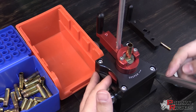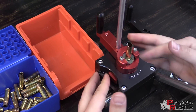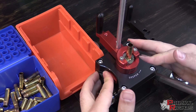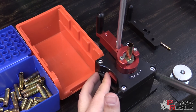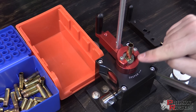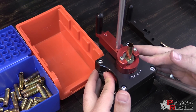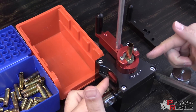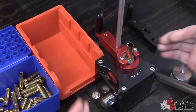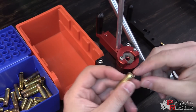I'm going to keep going until this handle stops moving forward towards me. If the handle gets stuck, you can give it a little help. Once it stops, I'll go back and seat deeper until I see the handle move a little bit — and it looks like it did. Now there will be a little play between the casing and the shell holder, so you might need to play with that adjustment. Each click is one thousandth of an inch, so if I wanted to take up that slack, we'll just go three thousandths. That should take most of the play out.